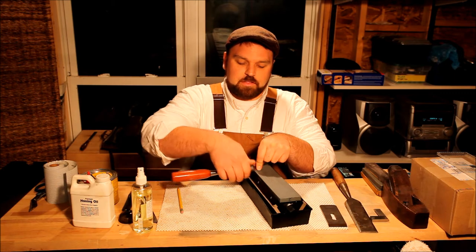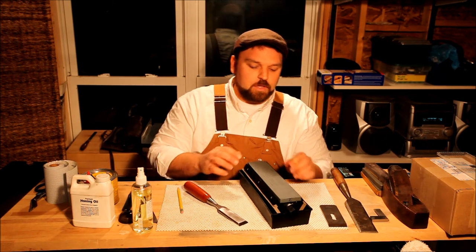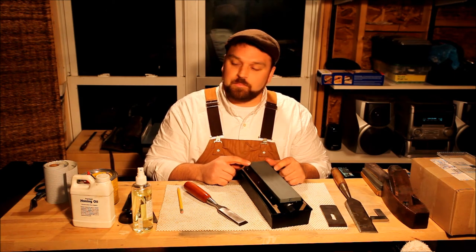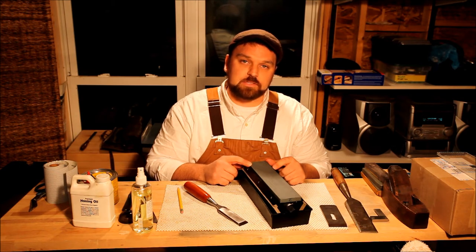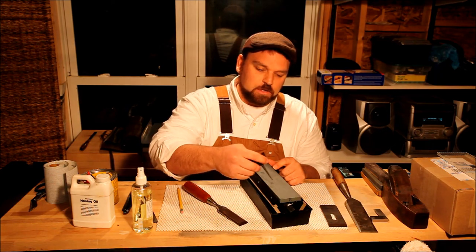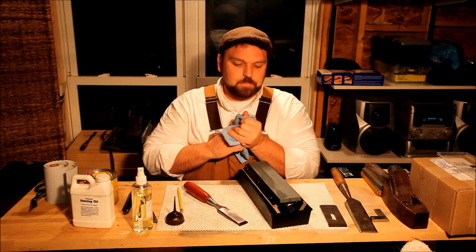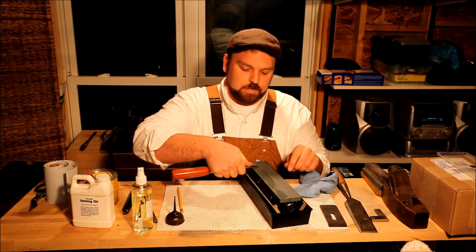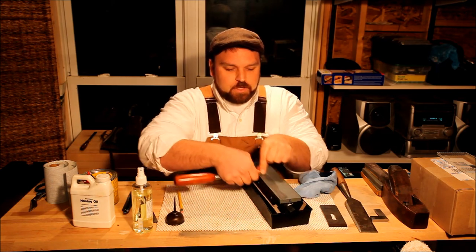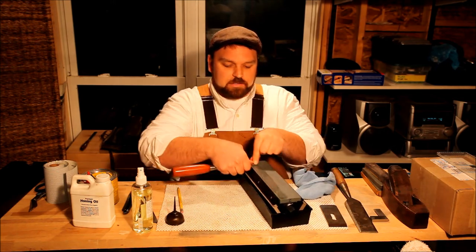The only point that's super important is this last little bit. Basically, you want to get the bottom part nice and flat so that it intersects perfectly with your nice polished sharpened beveled edge. If you don't flatten the back, it's got all those big machine marks on it which under a microscope look like mountains and valleys up on the edge — what you really want is a nice flat polished surface. So set back to the last inch or half inch on the chisel, rest your finger on the plastic guide, make sure the chisel back is flat on the stone, apply pressure with two fingers at the front and back, and gently guide it back and forth.